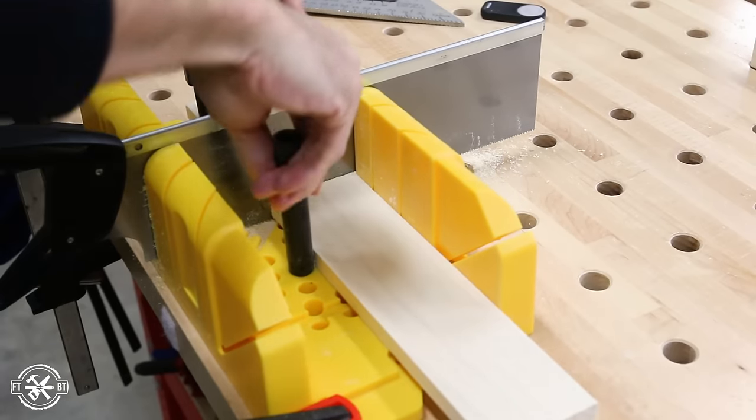I didn't use any glue on any of these joints since it's just a spice rack, but if you're a belt and suspenders type of person, you can use glue on all these joints as well. To fill in the sides and make the rack stable, I cut parts from the second 1.5 inch board. If you want an exact cut list and plan, I've got a free download available via the link in the description for all these projects. I glued the three pieces together and clamped them for about 15 minutes before attaching them to the spice rack. I just squeezed the end panel in as tight as I could and then attached it with screws from above. I did get a bit of tear out on the countersunk holes at the edge and filled that in with some sawdust and glue when plugging the holes.